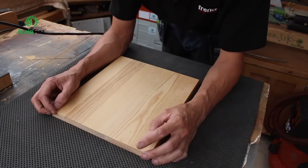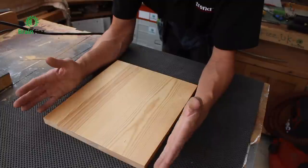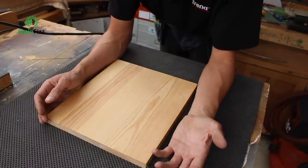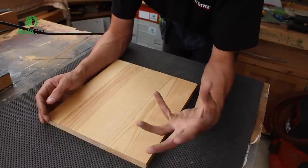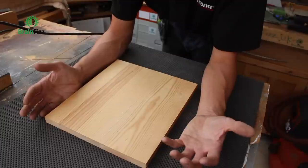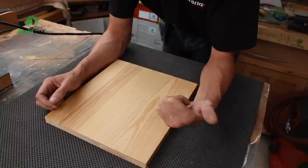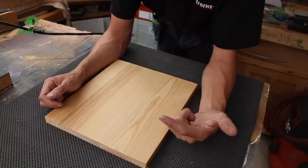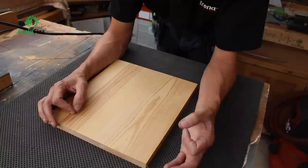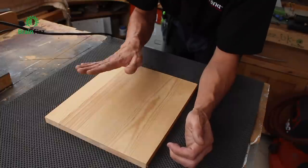Because I'm working on solid wood — this is a piece of pine — there's actually no requirement health-wise for me to wear a mask. Pine produces what's referred to as nuisance dust, and it will be removed naturally. However, if I'm routing MDF, hardwoods, or some exotic stuff, the dust produced can be toxic and a mask is required. For this piece of old softwood pine, there's no requirement. Obviously there is still a requirement for safety glasses.